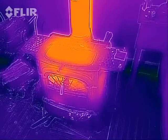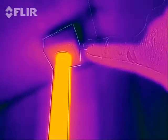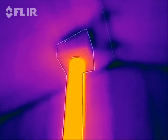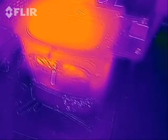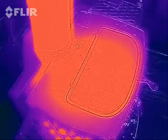I started this fire right now so that in a little bit I can go up into my attic and take a look around that sheet metal box. Because above that, it's actually a double-wall stainless steel insulated chimney pipe, so I should be able to add some insulation around there and keep that box from sucking the heat out of my house.